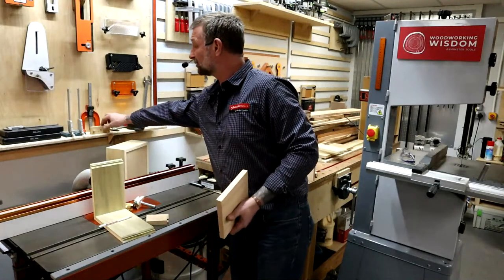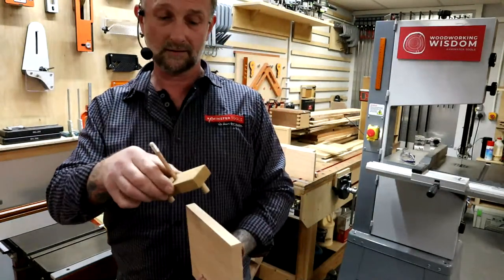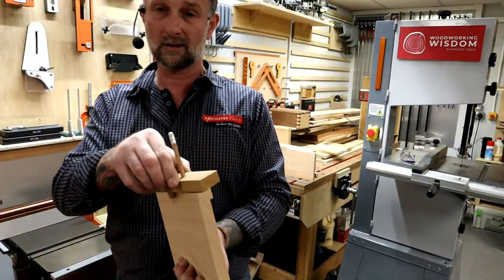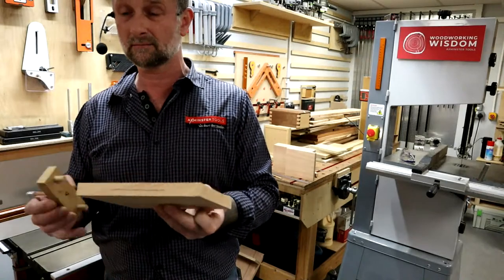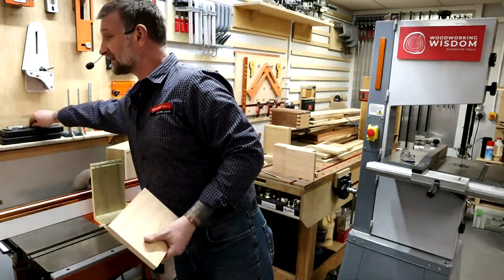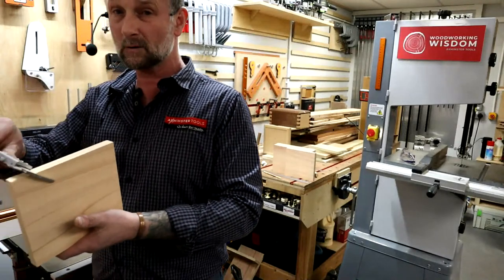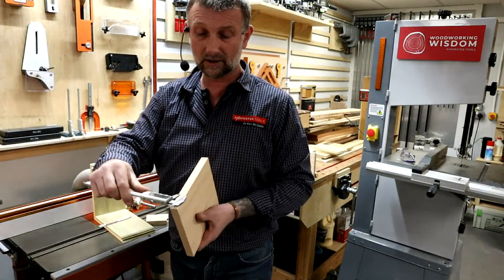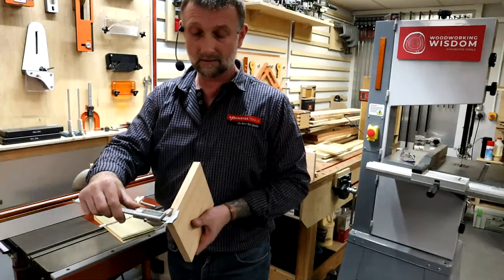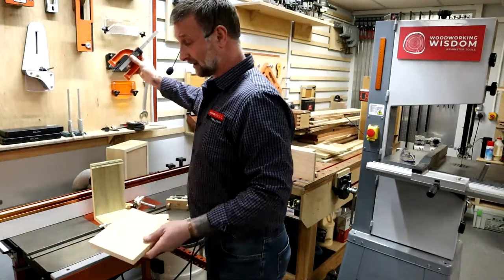You could just use a little gadget like this that you make, twist, plonk. There you go. Central line. You could get yourself a set of calipers, get a little bit more precise about it. All right. We could do that. You know, 18 mil, half is 9, to make a little scribe line there. Or you could use something like this one.